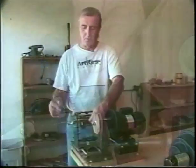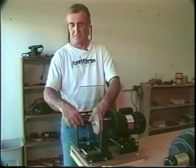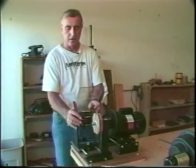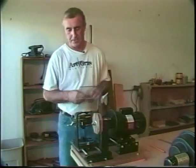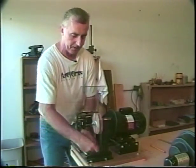Cut the set screws and it's ready to go. You want a spacing of just over an inch, maybe an inch and a sixteenth. The other thing is the angle that we want to cut. The initial one we want to cut at an angle of 19 and a half degrees, and the reason for that is our stock is 7 eighths inch thick.